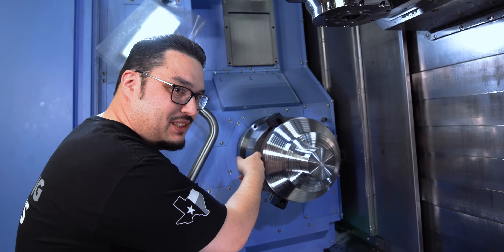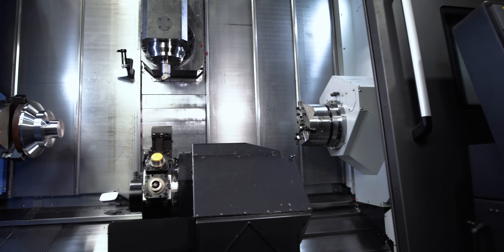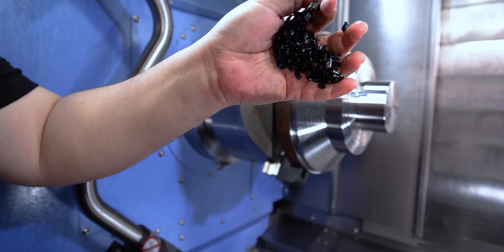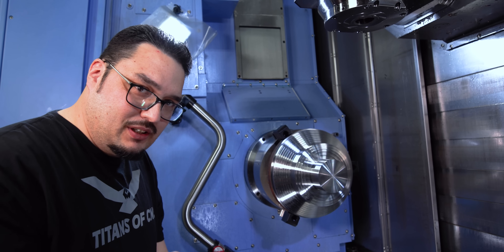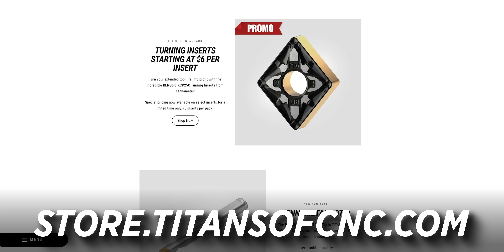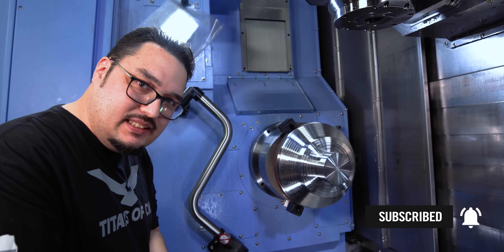And best of all, this Rota THW chuck kept it all in place. No matter if I took a 30 thousandths depth of cut or the 200 thousandths depth of cut, I was getting small chips coming off this tool the entire time — those perfect blue small chips, just small enough so they're breaking off, discolored so all the heat is pouring off the inserts onto the chips. I'm really impressed with these inserts. Travis has got a part he's programming right now using these same inserts, so you're going to be seeing them again soon. We have a promo on our store starting at $6 per insert — if these cuts impressed you, go check it out. Thank you for watching, hit like and subscribe, and I'll see you next time.